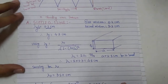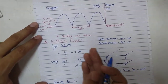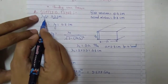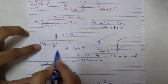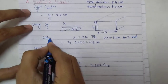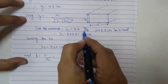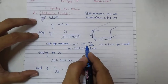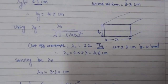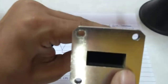Since the wavelength measured is for the standing wave, if you use this lambda directly to calculate frequency your calculations will be completely wrong. You must first convert the guided wavelength to free space wavelength. Multiplying 2.1 by 2 gives λg = 4.2 centimeters. The formula is: λg = λ0 / √(1 − (λ0/λc)²), where λc is the cutoff wavelength of the waveguide. For TE10 mode, λc = 2a, where a is the broader dimension of the waveguide.